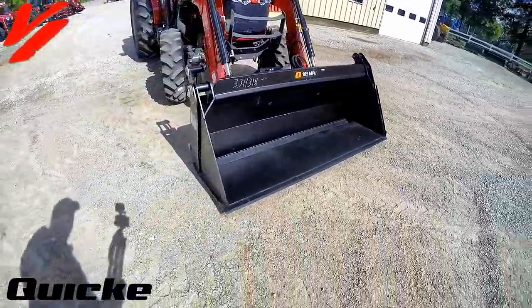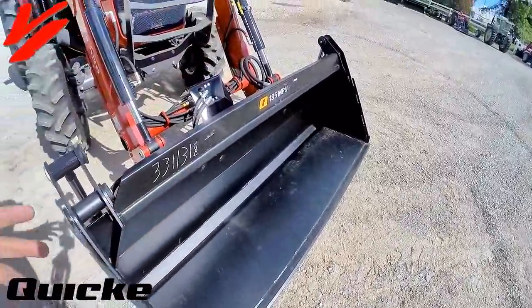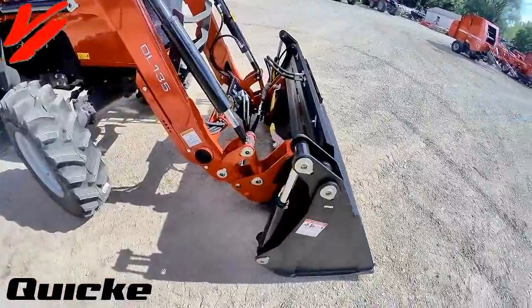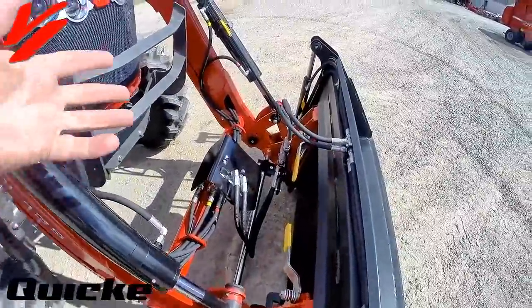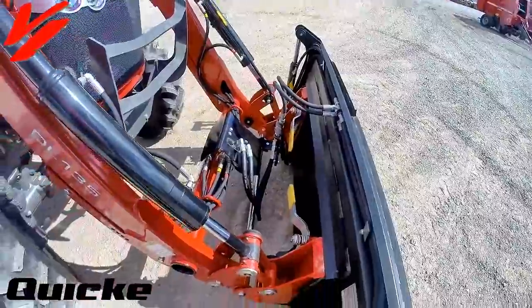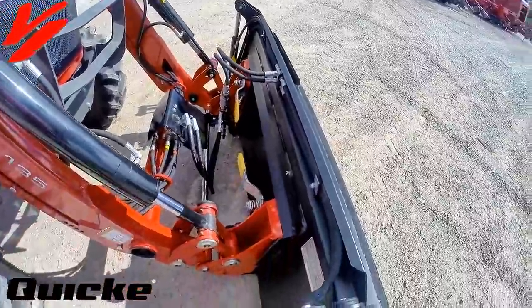Bucket. This is a 4-in-1 bucket. Besides the traditional bucket like that you've got, this bucket has hydraulics on it. It utilizes third function, as we're showing here on this 1760M Massey Ferguson. We've added a third function kit to it. It allows us to use a solenoid third function to divert the oil from the tilt cylinders to the third function option, and we'll show you that.